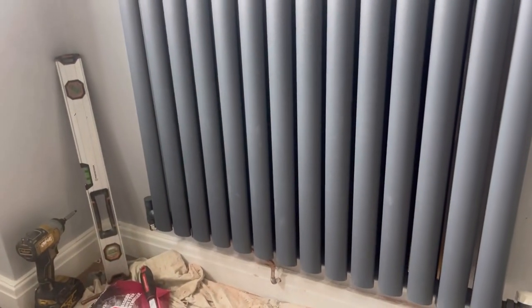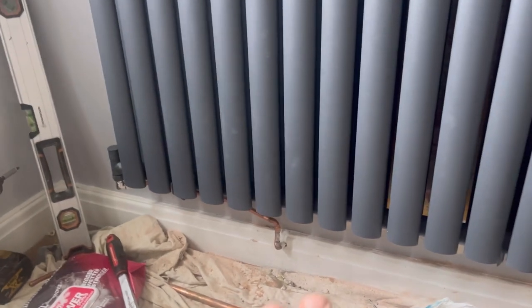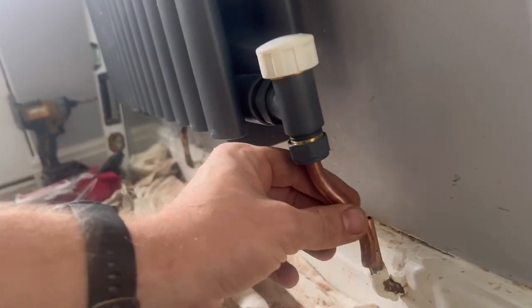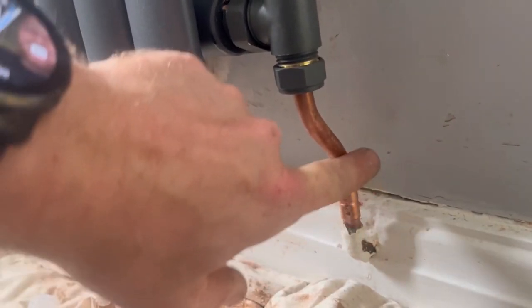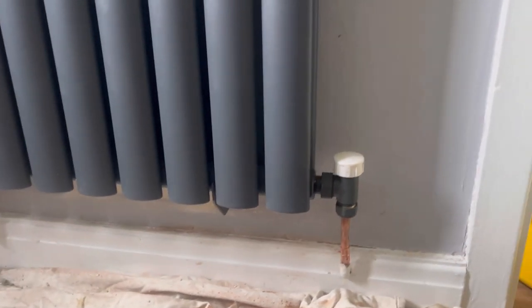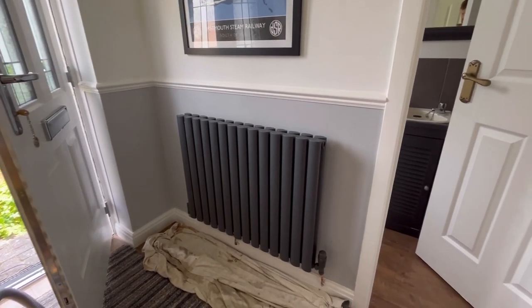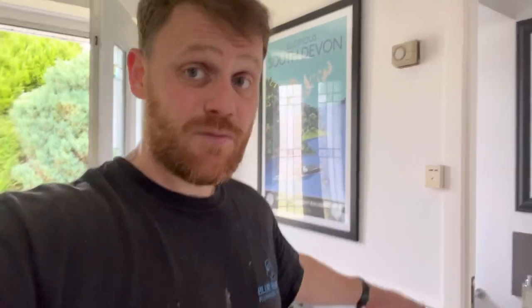You're already going to see that I'm up above — and really, you don't want to cut the wall out and move the pipe. But I could keep doing that — and the customer's happy with it. Look at the difference — it's quite a big gap, so I bent a bit of pipe — that'll be straight in there. Look at that for bending skills! I've managed to bend that pipe, got it in the coupler, just got to solder up here. That looks sound — there we go, that is all done. You could barely see it there. It looks a lot smarter than the old one. I'd rather have been able to get in there, take the wall out, move the pipe — but sometimes you have to make a compromise.